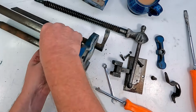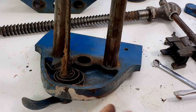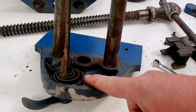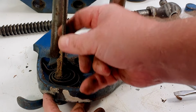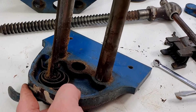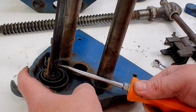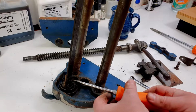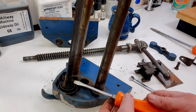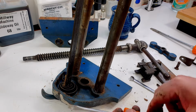And then the last piece to take off is the quick release handle assembly. So that's held on with just one screw here. So we'll take the screw off, then this will pop out and we should be able to free that up. So let's see how tight that is. Hopefully not too tight is the answer. No, that's just right. So always good news when the screws come out nice and cleanly like that. So you haven't got too many problems. It's not all horribly rusted.